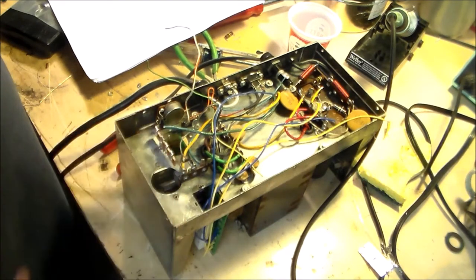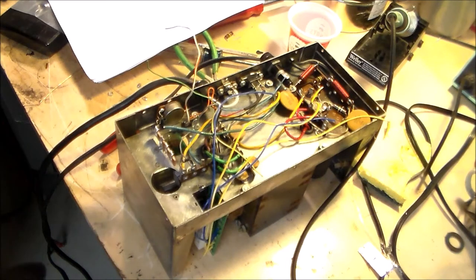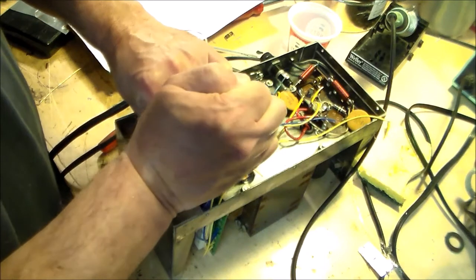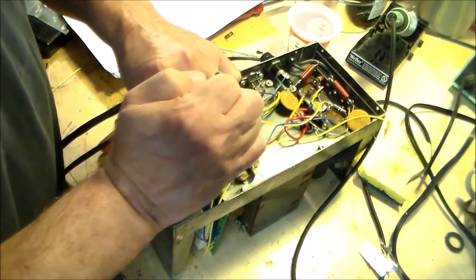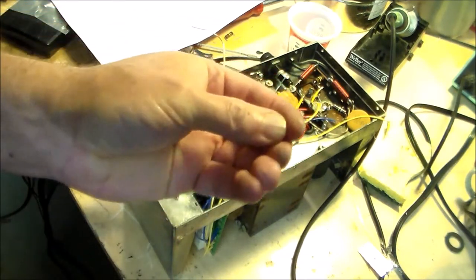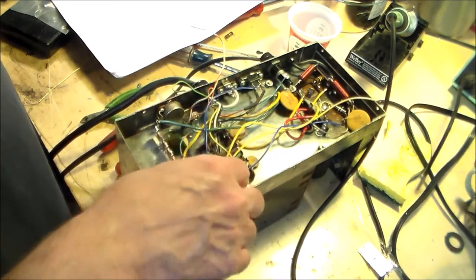Still thinking that that diode's got to go. But in fact, I've got the other one open here. Let me take a quick look. Aha! Proof positive that that diode needs to be removed. The other working AC-4 does not have this diode here, so we can remove it, oh jeez, it's on the floor, we can remove it with a reasonable amount of safety. Okay.